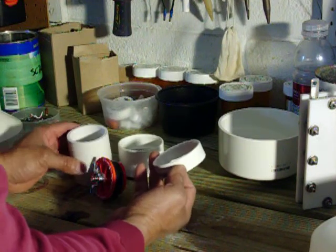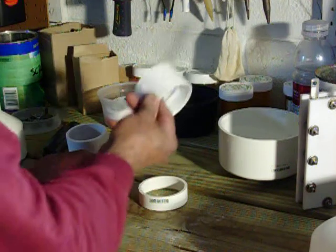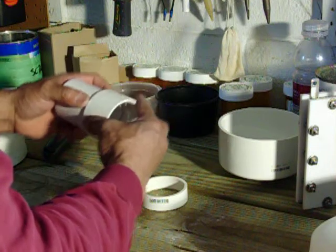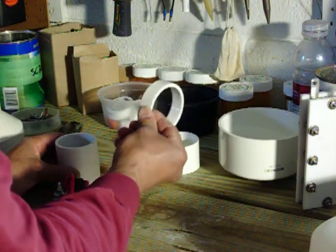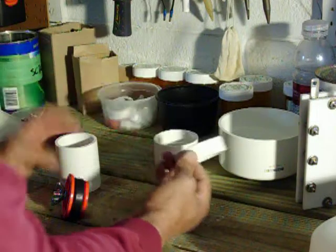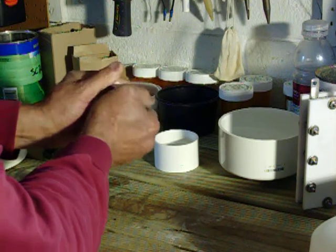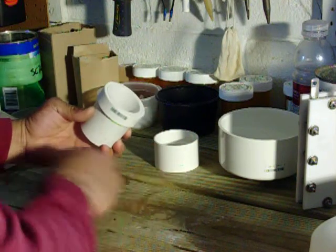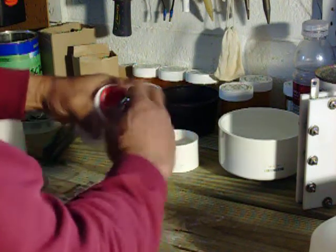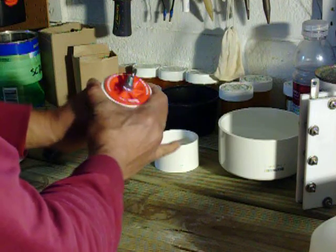I just did another video with another experimenter who shared this with us. He took a regular 2-inch coupling — it goes in here and another pipe goes on the other side — and cut it in half. If you have a miter saw or a steady hand, you can cut it in half. Then you slide it onto your 2-inch pipe, gluing it, and it would look like this. When you put your plug in, you can really crank down on it. What that accomplished is it gave the pipe wall some extra strength and reinforced it.